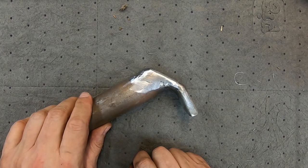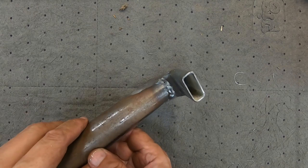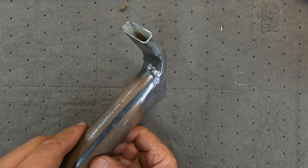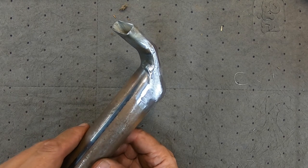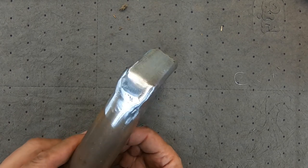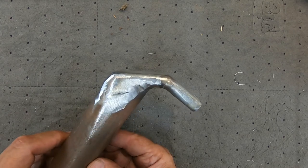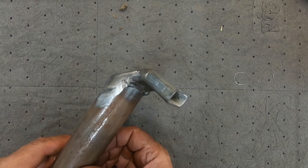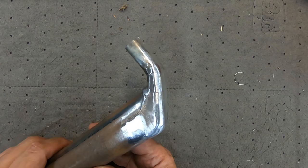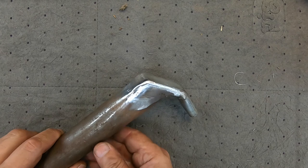As that saying goes, something like 'an angle grinder and paint makes me look like the saint' — something like that. I'm showing it because it's just what I can do, I'm not ashamed of it. There are obviously any number of welders better than I am, but it's stuck on there and it isn't going to leak. It's not really a pressure vessel — well, I suppose it is, but a vacuum cleaner on its best day struggles to come up with four or five pounds per square inch, and chewing gum will hold that. No problem with these welds.